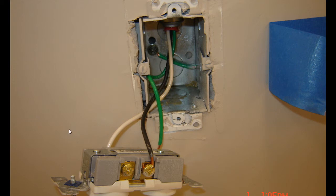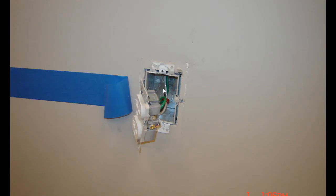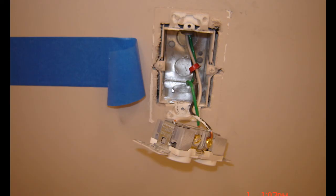You have a couple of different options. On a surface mounted box, if you have that bushing — that little fiber screw holder — if that's removed and then tied into the box, you're good to go. You can also use self-grounding style receptacles, which I'll show you a picture of in a minute. This one here doesn't even have a ground screw at all — the anti-short bushing fell out — and there's where your ground screw should go, right back there.